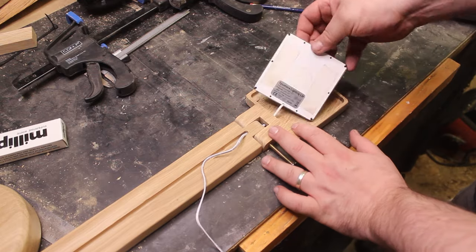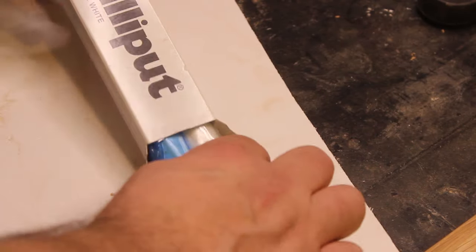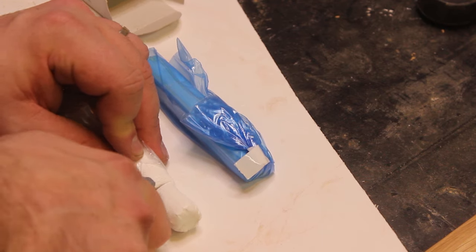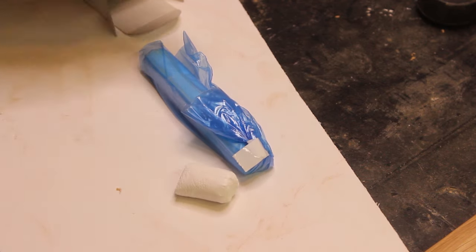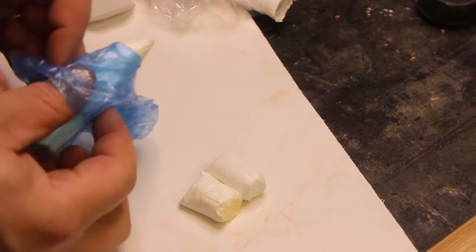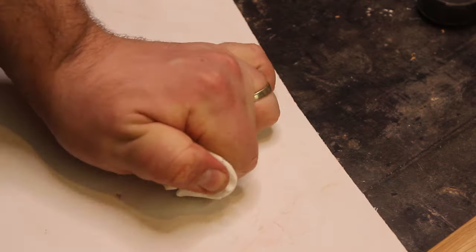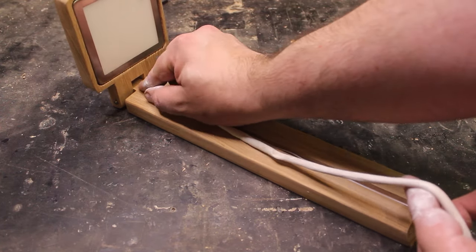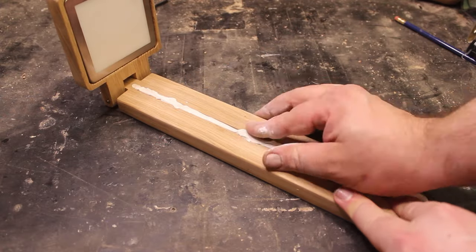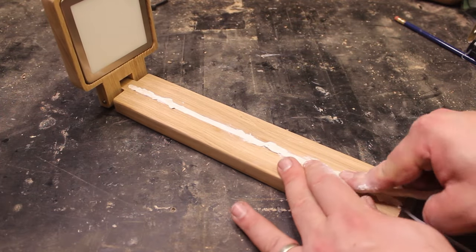So now it's time to start with the final assembly of the light. The first thing to do is to stick the LED panel in — I'm just using a pencil there to line it up. I'm then going to use some Milliput, which is an epoxy putty, to fill that channel now that I know exactly where the cable sits in it. For Milliput — I'm sure it's the same with a lot of these epoxies — you cut equal sized pieces of the putty itself and the hardener, and then the task is to smoosh that together until it's all thoroughly mixed through. It's a lot easier if your workshop isn't cold. I've rolled out a long piece and I'm just pushing it into that groove over the top of the cable. It doesn't really matter if it's particularly neat — so long as the groove is completely filled, it will all be dealt with by coming back with a sander.